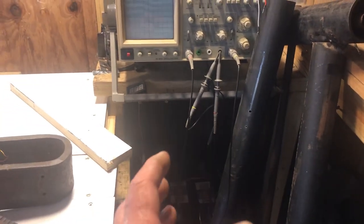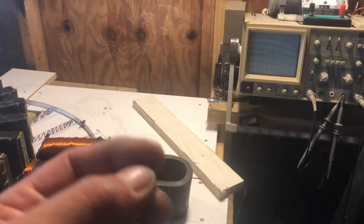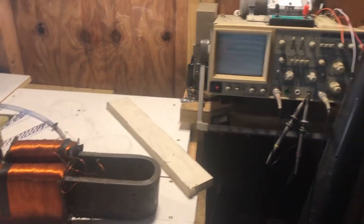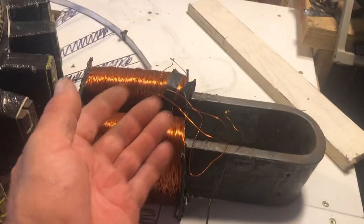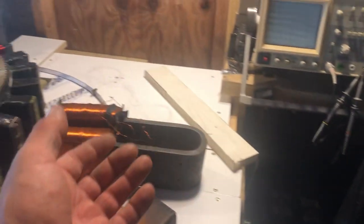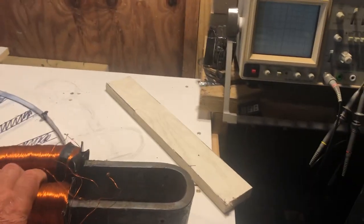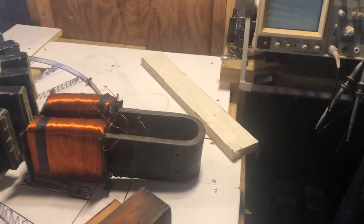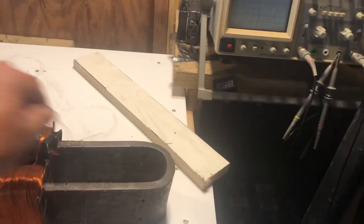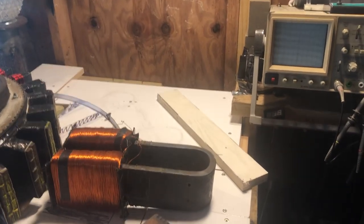And if you go 24 volts, what I'm getting at is whatever you hook it up to is what allows the current to come into the circuit. For instance, this right here is thinner wire. So basically, with 24 volts, they would start to warm up because these cannot handle the current. But it knocks the current down because of the resistance that's in here. So they're going to get hot, okay?